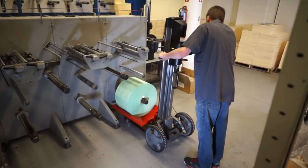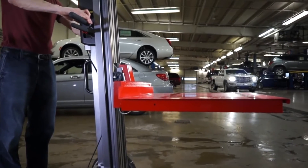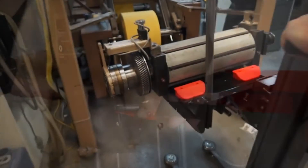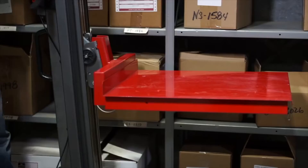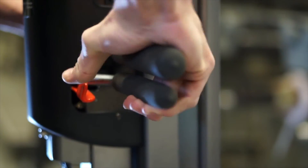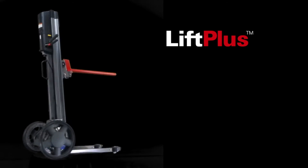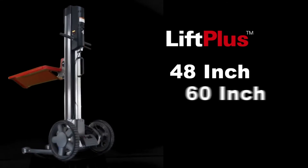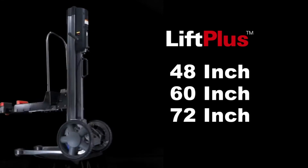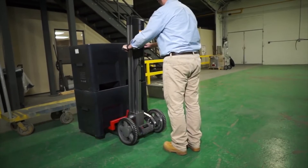We also have forks with removable steel pallets for items that are flat, like stamping tools or plastic molding tools. Round items can actually fit between the forks so you have two areas of contact. We have a fork with a v-tray option, which allows for multiple diameter rolls from 9 inches to 24 inches — nice for the packaging industry. We also have an arbor that can fit inside the cores of round material or reels, such as foils or other sensitive materials you don't want to lay on a flat surface.